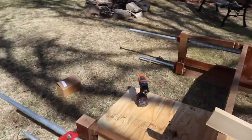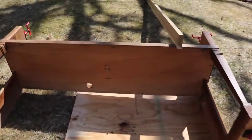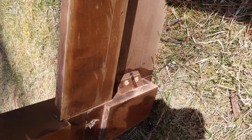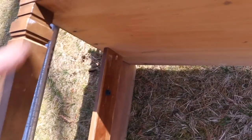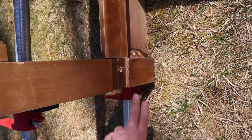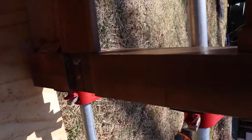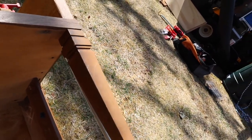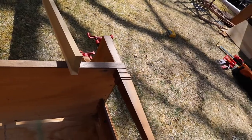Alright, so usually you don't need as many as you might think up front. So all I did was, I've got 2 going through that piece of wood that's already glued on. So I'm going to go through 2 there, 1 up top, through the bottom of the bench board, 1 coming up into the bottom of this board. Rather than going through the whole meat of it, I'm actually just going to do 1 through here. And again, that doesn't need a whole lot because there's all the pressure of the weight of the bench sitting on that anyways. So this is really just extra because the glue is going to hold most of it anyways. 1 more up top there. That way it's not overdone and it's pretty easy to take apart if I need to.